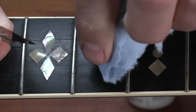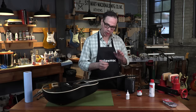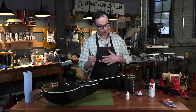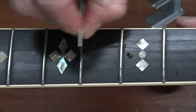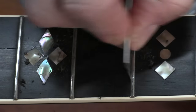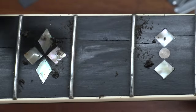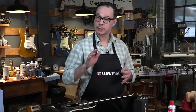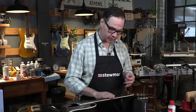Wipe off a little excess. Now I'm going to take a fresh razor blade — keep a good supply of fresh ones around. You don't want to use the same blade you used to apply the glue for what we're about to do, which is scrape this board. I'm going to scrape back and forth gently between the frets, not pressing too hard. This is going to level the crack out and it's going to create a small amount of dust that's going to work down into the crack and mix with my glue and create a slurry that fills that gap. I'm just going to keep repeating that until the crack is completely filled and it's leveled to the top of the board.